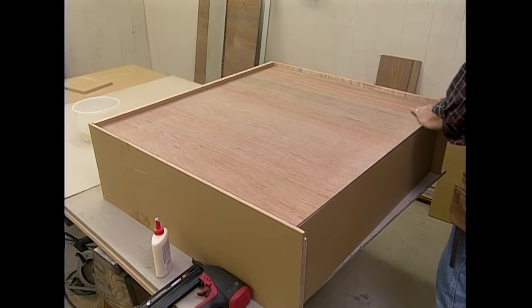Here I'm tipping my saw blade to 45 degrees to rip some cleats to hang the cabinet. The cleat I just ripped is going to get attached to the back of the cabinet — I want the angle to go up towards the back. The cleat for the wall is set to a level line with the bevel going towards the wall, and I just attach it with some two-inch screws. This system is really simple, has incredible strength, and if you leave, you just take the cabinets with you. These units will get doors later and we'll put some open shelves between the two units. In the meantime, let's get started on the base cabinets.